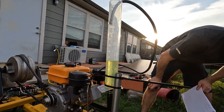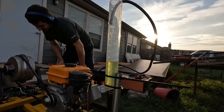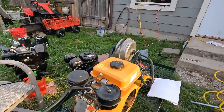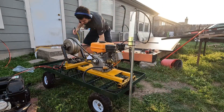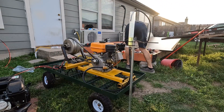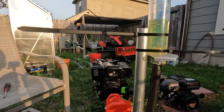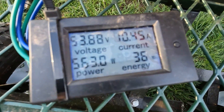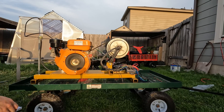The testing setup I built seemed to work perfectly. The graduated cylinder - I kept calling it a test tube, my bad - seemed to be a very accurate way of measuring fuel consumption with the watt hour meter. Assuming the watt meter is accurate, this should be pretty close. It will be interesting to compare this to the gas engine and the other big diesel. The big diesel actually has a slightly bigger pulley - 3.5 inch versus 3 inch on the small one - so we'll be able to run similar power at a little lower RPM, which may actually help efficiency.